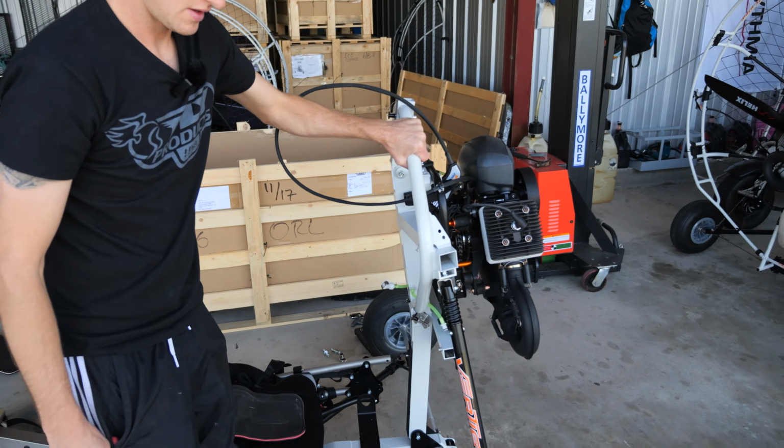One of the things that we mentioned earlier when we were putting the trike together was that rear bracket on the bottom of the trike, and it's for a stinger system. What the stinger system is, it's essentially a scooter wheel, but that scooter wheel on the back of the trike moves up and down as you taxi, and if it gets too far down, because it always has downward pressure, it's actually going to kill the engine, and it's what we would consider a dead man switch. So the student is actually not allowed to fly until the stinger system is switched off.